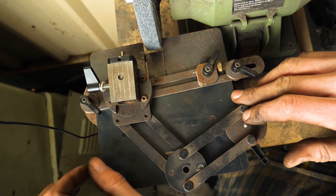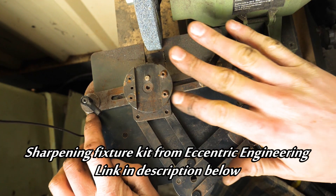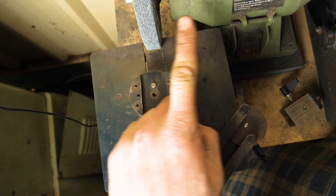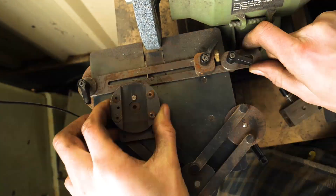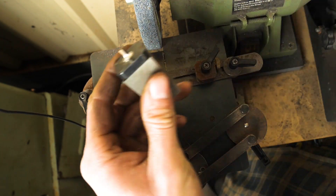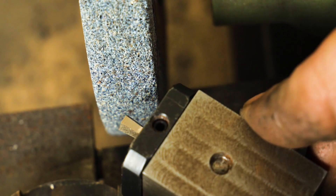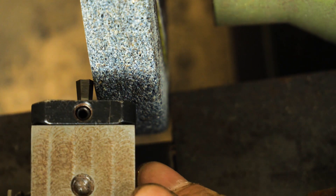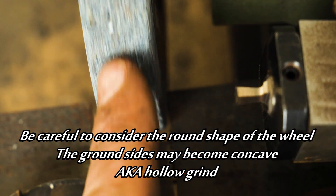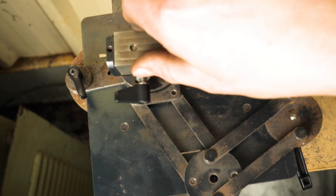Now let's look at a more elaborate fixture on the bench grinder. I've got this setup — I didn't design this, it's a kit from Eccentric Engineering, an Australian company, not sponsored. This is an end mill or lathe tool sharpening fixture. There's a parallelogram setup which keeps whatever tool you've got constrained rotation-wise, and then there's the rail here which constrains the parallelogram to run in a line. The tool block I showed you earlier is from this set. You need to have a think about how we grind our tool — grinding on the side isn't great; the preferred method is to come from the side and grind the tool on the front edge.